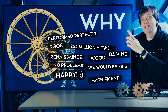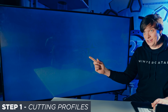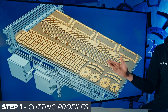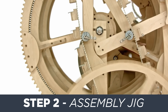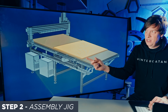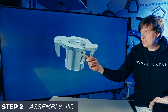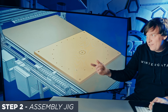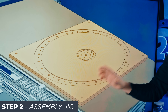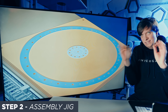So that's why. Now I want to tell you how I'm planning to make these new gears. Step one: cutting the profiles. We start with a CNC machine, then we manufacture all these profiles. Step two: making the assembly jig. We're gonna make a straightening and gluing-up jig. We have some MDF, and we do some machining operations — cut-downs. We're gonna use T-nuts, put these T-nuts in all these holes. With x-ray vision you can see the T-nuts underneath. Next step: cutting alignment holes. Then we CNC these flats. All the blue areas here are now CNC-perfect.